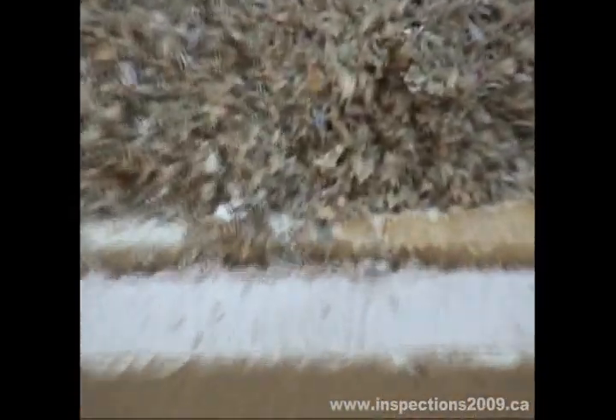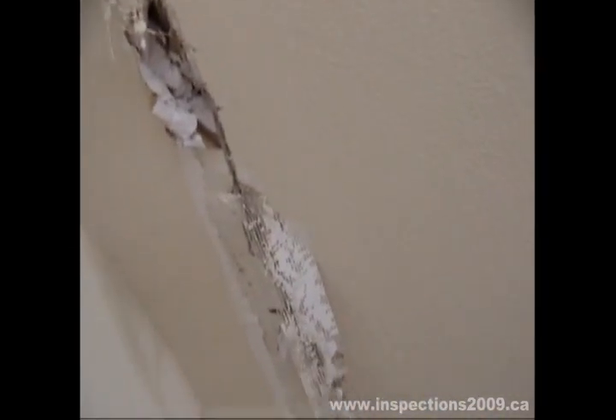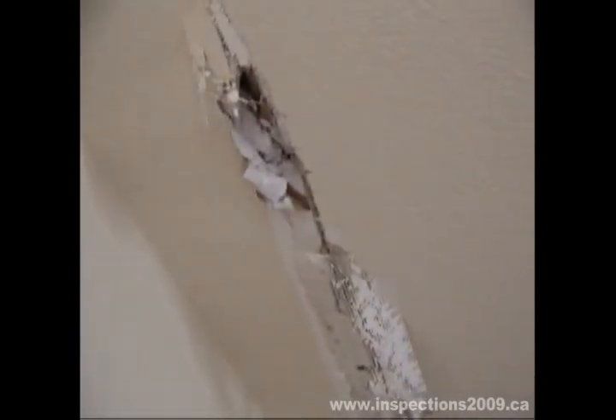No poly in the roof. This area here is the roof which uses a spray vapor barrier, and you can see the repairs — we have repaired this roof three times now because the ground movement keeps cracking it. In my opinion, the spray vapor barrier will keep cracking and compromising the seal.